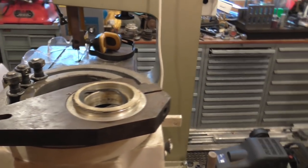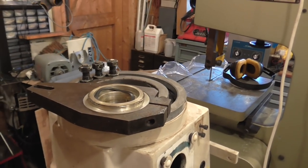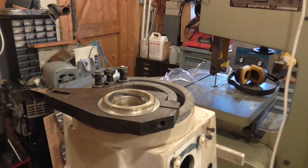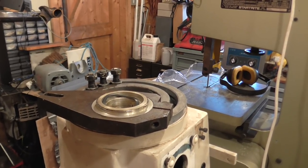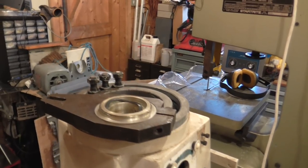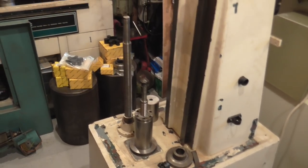You know, the spindle's again on the trolley, and I machined up a steel replacement nose cap, but I still didn't want to drive the quill with this clamp plate arrangement. There's quite a limited travel, and it's obviously not a particularly strong way of doing it. So I decided to convert the machine to knee-driven operation.